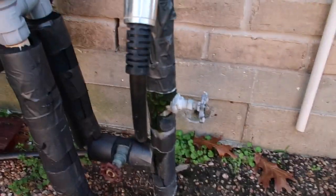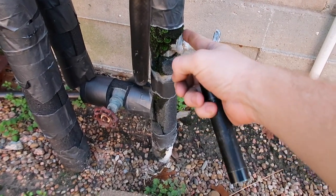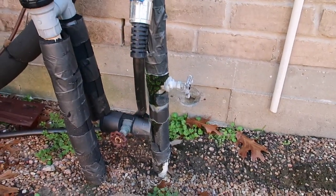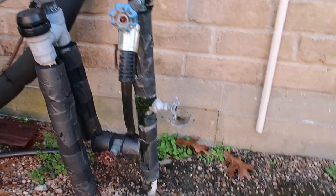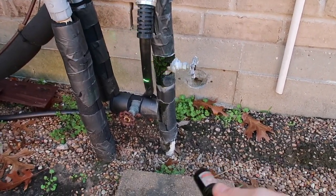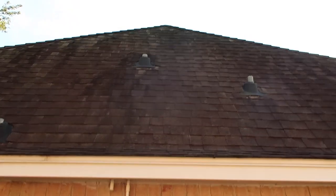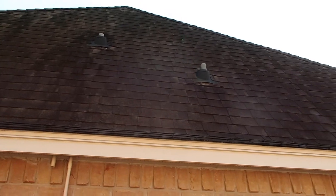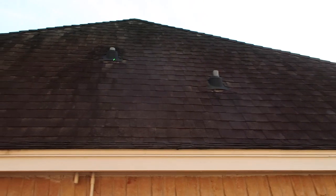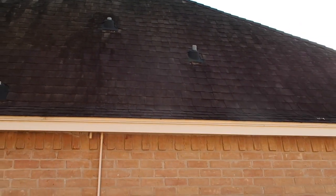Running around the outside — if you ever see any type of algae or green moss-like features around any type of plumbing, that means it's leaking. This is a fantastic find as a home inspector, because you know how much we charge and how much a plumber charges. Just this call-out alone can save them the whole price of the inspection. Also, looking at the roof from the ground level, you can see these rubber boots are starting to warp and deteriorate because of sun and UV damage — easy areas for wind-driven rain and water leaks.